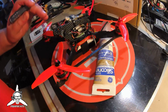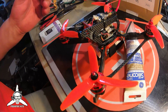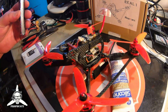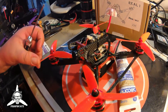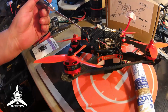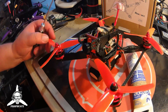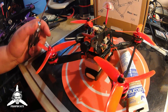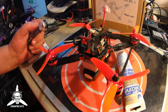The VTX is the TX-801 - it goes from 0 up to 600 milliwatts. Good VTX, but be careful running it at 600 milliwatts because it gets pretty damn hot. We're running the RunCam micro or mini, and that does have OSD onboard for its camera setup with all the feature functions readily available. You can do an external or internal switch depending on what type of goggles you have - you could use the SkyZone goggles and actually be able to control that.